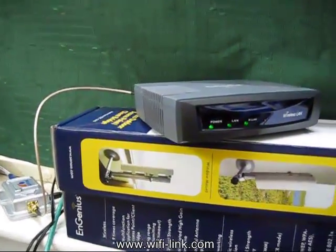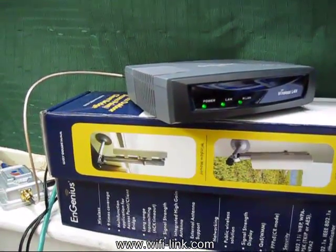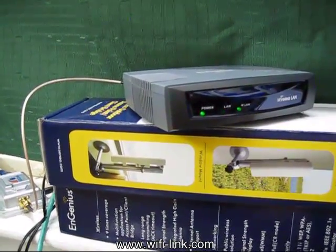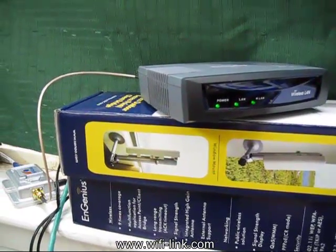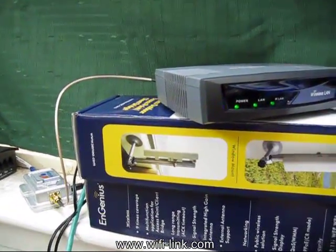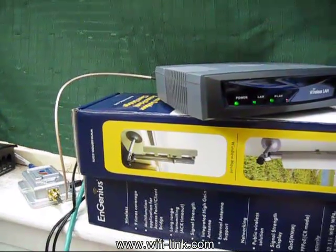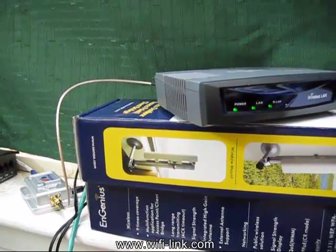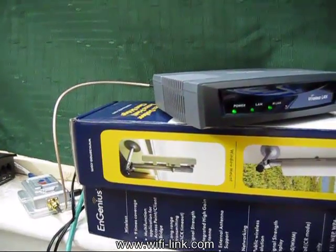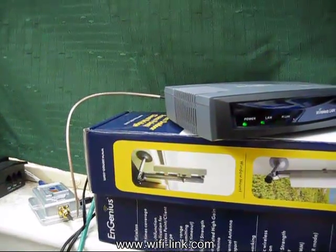There have been many antenna designs for wireless that have showed up on YouTube — some like the Pringles can antenna and some like the Yagi antenna. All of these antennas that you can make yourself, just buying some simple parts from Home Depot, have one problem: they require you to spend something like $30 to $50 and their performance is really narrow. If you have incorrect measurements by as much as a few millimeters or half a millimeter, you might end up with a directional antenna that actually gets better omnidirectional performance.